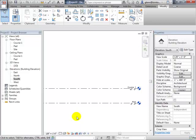Now for course one, help me with this, because I haven't actually laid brick in a while. By the time I take in the brick and the mortar thickness to get it to the second course, how much is it? 2¾. Should be 2¾. That we want to use as a standard? It depends if you use half or 3/8 mortar, so everybody's going to be different. Go ahead and use whichever makes the most sense to you. But I'll use 2¾, and we'll go with that.